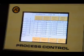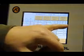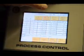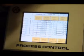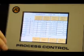What we're looking at is the time weight table for the main ingredient gate. Here you can see time versus weight dispensed. We build this table up, and from that, when we have a desired weight we want to hit to finish up a weigh shot, we go into the time weight table and we can actually take that number, reuse it, and get a fairly accurate, a really accurate fire of that weight.